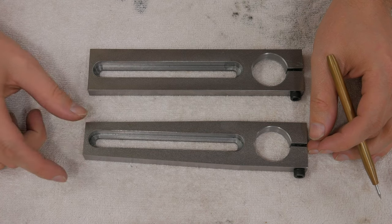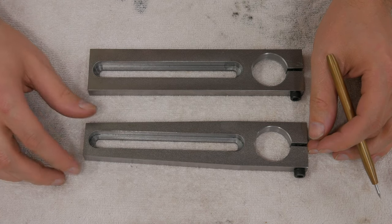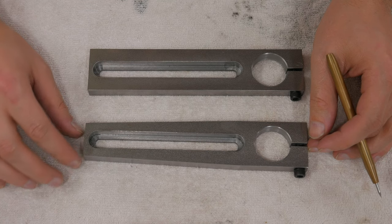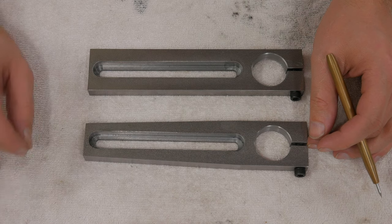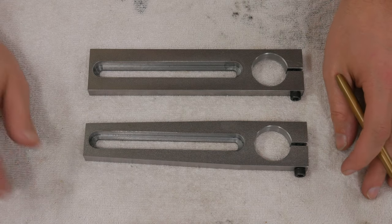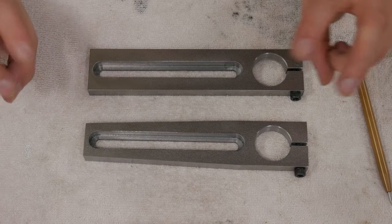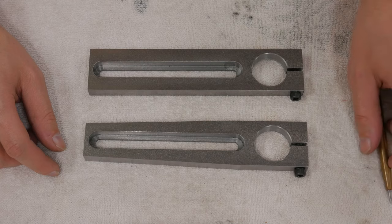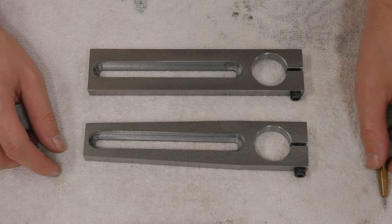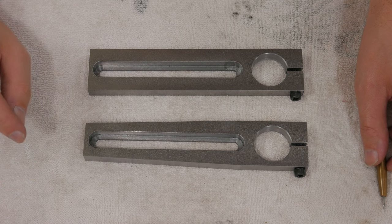The target on this edge was 1.2 inches, plus or minus 10 thousandths, since it's a cosmetic thing. And I came in at 1.204 inches, so I was within tolerance, and actually pretty close to the target, considering all of the places where I could have inaccuracy, so I'm pretty happy. I'm gonna do the other two off camera, and then I think that'll be it for this video, and when I come back next time, I will start working on the studs.